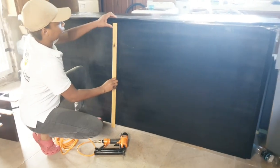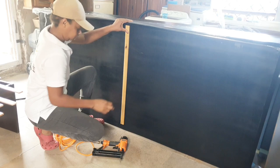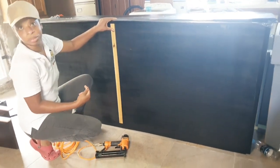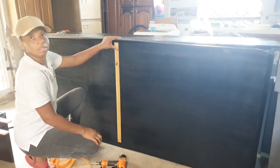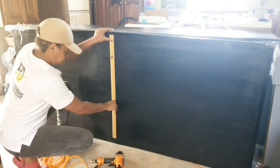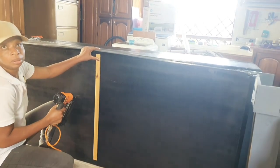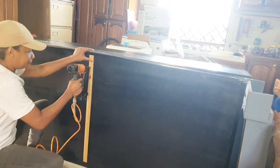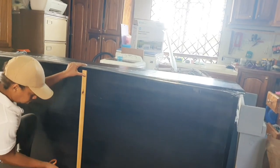This was when I was explaining to my partner how we are going to attach them. I'll be doing a lot of measurement around the back because the stapling has to be precise — if I miss one of the staples, the plywood will chip out at the front. This part was one of the most tedious parts of the job. I missed about three staples and chipped out the plywood at the front, but I was able to fix it.